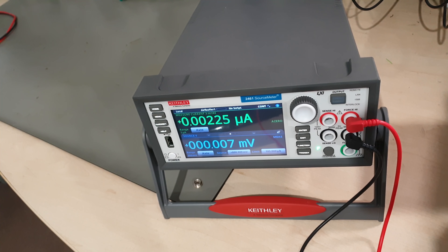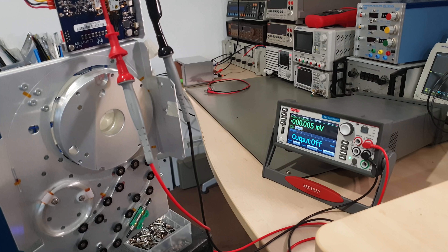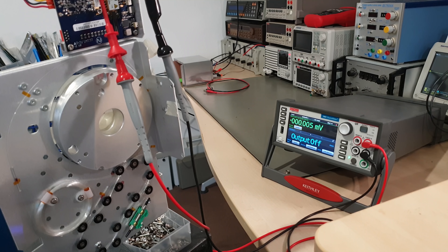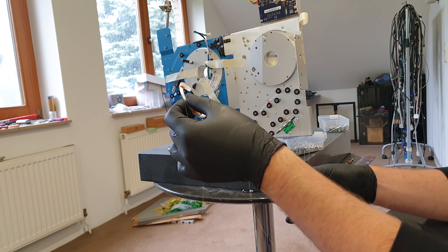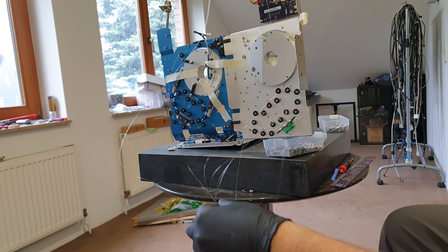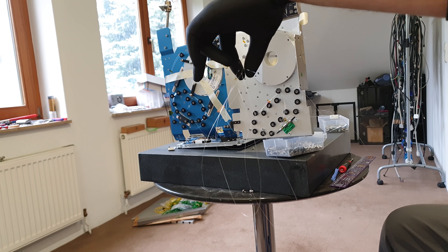We still cannot pew pew ahead, because the initial problem is not yet solved. The output beam delivery cable is still severed, and in that state it would have substantial internal back reflections. Those could make their way back to the fiber amplifiers, grab even more power on their way through, and just fry whatever component they meet first. I have a couple of ideas to solve this problem, and a couple of experts to talk to.